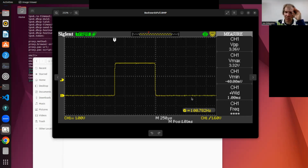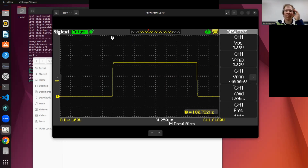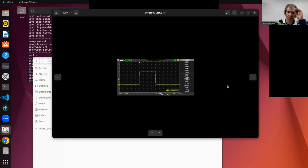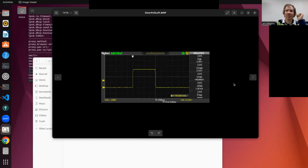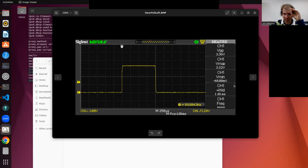And so when you dig into the servo object in Arduino, or under the covers and how they do it, the only way you communicate with the servo is by sending a pulse between 1 and 2 milliseconds, or 1,000 and 2,000 microseconds. The exact ones vary a bit when you get down deep and dirty, maybe as low as 500 and maybe as high as 2,500. But that's a great shot that shows exactly how you communicate with servos just by reading the oscilloscope.